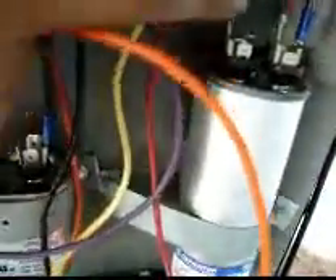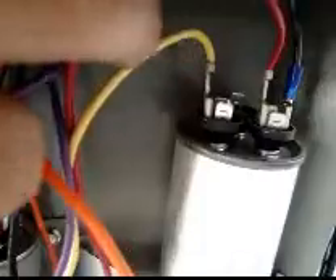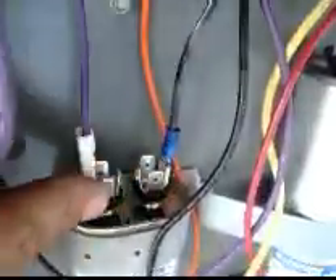As far as wiring it up — the purple wire right here actually went to the fan terminal on the old dual run capacitor. What you do is plug that into one side of the capacitor. Then there's another terminal on the dual capacitor labeled C, which is actually R power — if you trace it back it goes down to red on the contactor. It's just labeled C because it's a common terminal for this capacitor. Take another piece of wire, connect it onto the C terminal on the dual capacitor, and run it down to the other side of your fan cap.